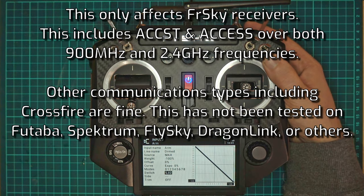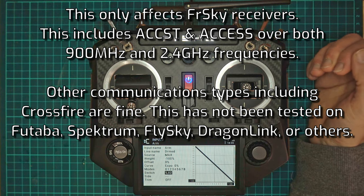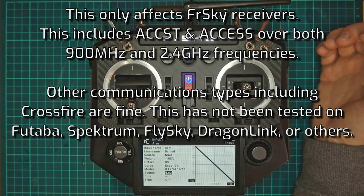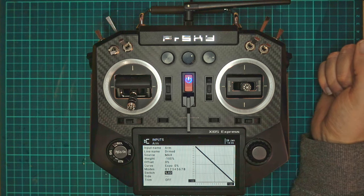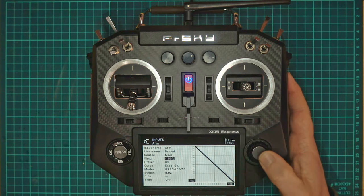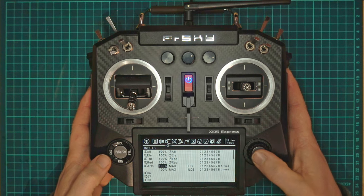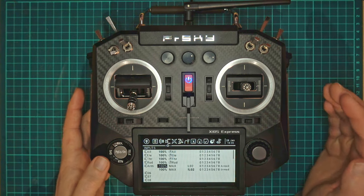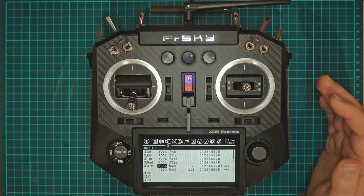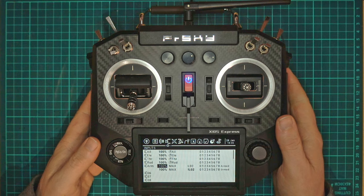If you're using INAV, at the moment there is a glitch with failsafes. If you have a failsafe in flight, not all channels will necessarily come back at the same time — it seems to be about 50/50 whether failsafes are good or bad. If not, you'll find that the arm channel is low, which will disarm the plane. So what we're going to do is reverse this: set disarmed to 100 and armed to negative 100. That means when armed the channel is at negative 100, and if we have the glitch, the arm bar in the modes page will still be in the armed region so we will not disarm.